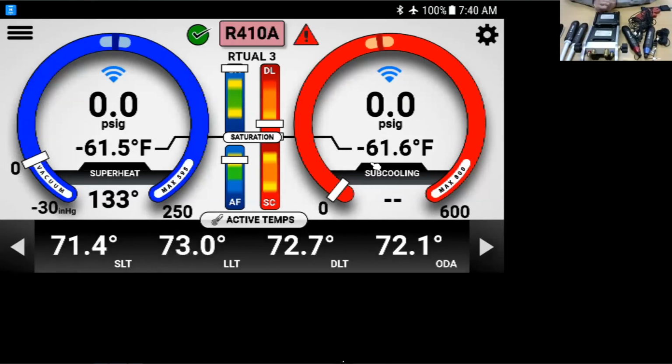You can also, again, you don't have to necessarily be in the duct. You can do it at the vents as long as you're at the closest vent, the first branch takeoff from the system. A lot of houses have 1 or 2 central returns. You can get in front of that central return with the return probe, and the closest supply to the trunk line, the first one that comes off for the supply air.